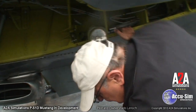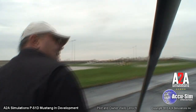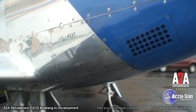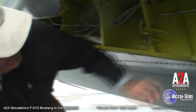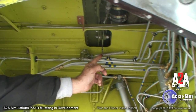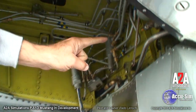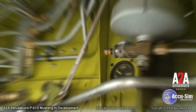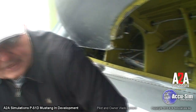Then we get up and walk around the side, making sure everything is okay — no major drips or anything. On the other side, same story: making sure there's no major drips, leaks, or anything from the motor. Then go back into the right wheel well and check the same things. The up lock — make sure that's secure. The hydraulic actuators — make sure they're okay. Over here is a hydraulic pressure gauge that shows the pre-charge pressure. You want to make sure that's at least 400, so that there's a pre-charge in the hydraulic system.